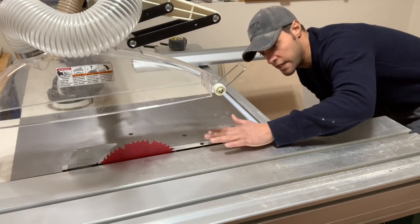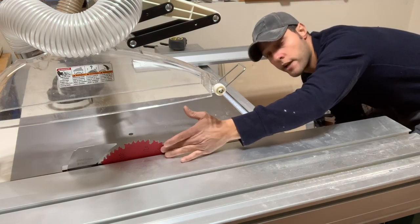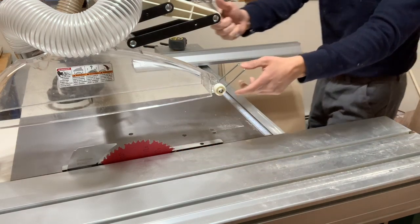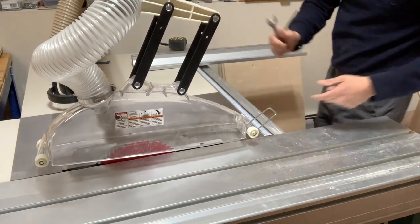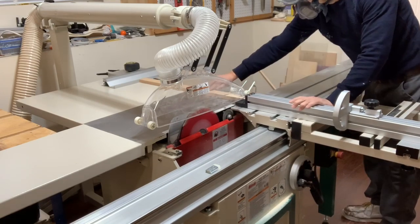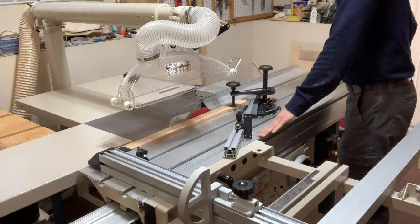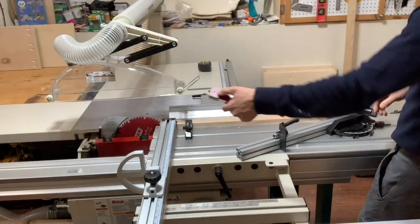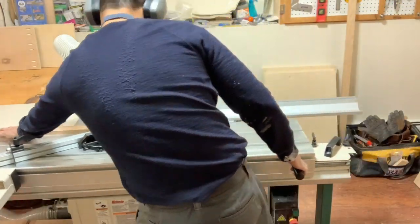When I cut the red oak for the edge banding and also the edge banding of the desk top, it will rely on just a combination blade. I've decided to make my own shop-sawn edge band veneer, so I'm going to use three-quarter inch red oak and cut it into thin strips a little less than an eighth of an inch, then glue and nail it on. I'll use this edge banding to cover off the edges of the plywood for the carcasses and the shelves.